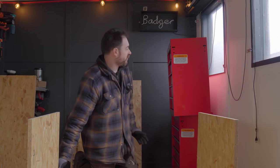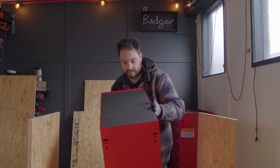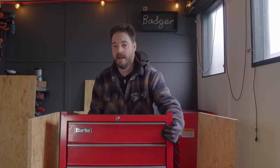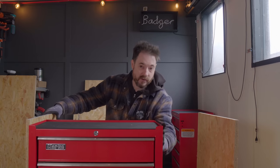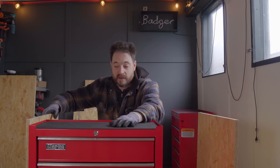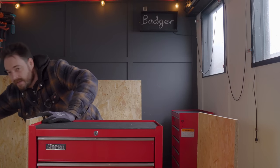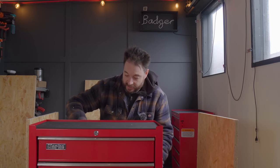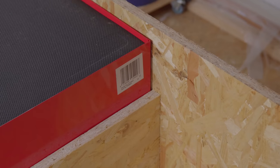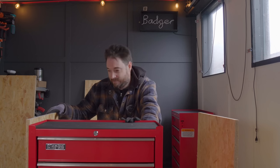The ends are on. My plan was to get the cabinets put in and these were going to add the rigidity. The second divider will go along here — with this in place that will stop the whole thing racking — but then I started to worry if that was enough. So with a bit of an off-cut, it's not quite as tall as the cabinets but that's fine, I thought I could go in the back behind the two of them and give some more strength. Now I've got it in here I'm not sure it's necessary, but I've cut it — what harm can it do?